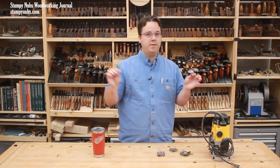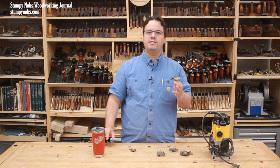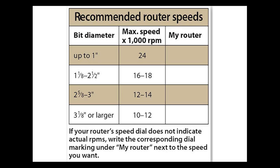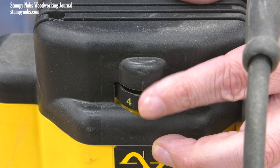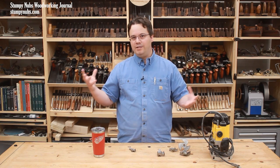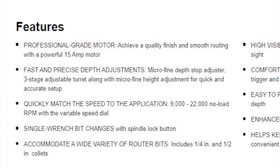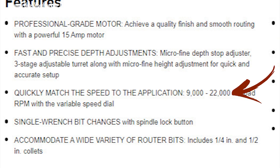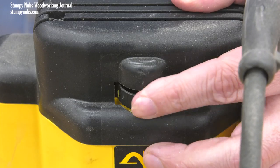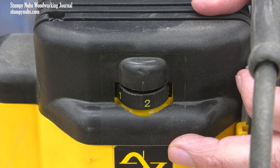So we have two different bits traveling at vastly different RPM but cutting at roughly the same speed — it's an interesting concept that some people have trouble wrapping their heads around. Here's a simple chart from an old magazine that you can use as a guide. Now, what if your router has numbers on the dial and not specific RPM settings? How do you know where you're setting it? The first thing to do is look in your manual or search online to find out the speed range your router is capable of. This router ranges from about 9,000 on the low end to about 22,000 RPM on the high end, so dial position 1 is 9,000 and dial position 5 is 22,000. Now you can do the math to figure out the settings in between and record them somewhere for future reference.